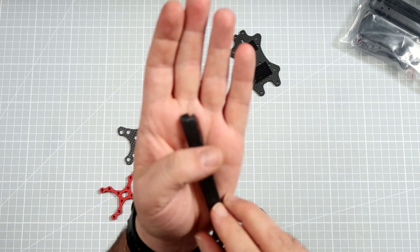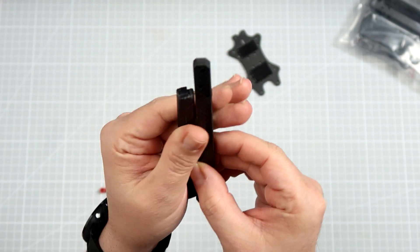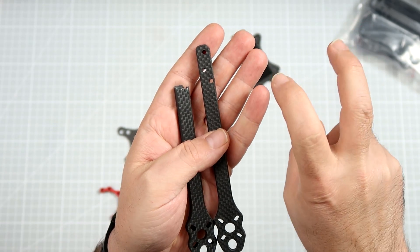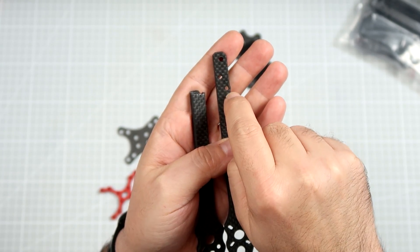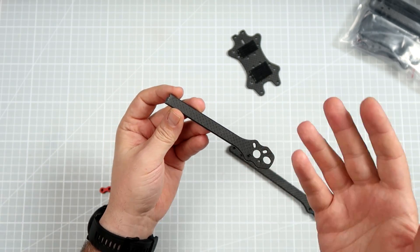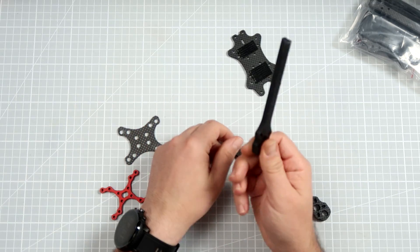I'll show you an example of the bad design. For the price, the Alpha Monster is great, but the arm just snapped off right here. Comparing it to an unbroken arm, you can see there's a mounting hole with a small bulge meant to make it stronger. Unfortunately, the hole is too close to the edge of the arm, so that small piece of carbon isn't really protecting anything. This is the weakest link — the most outward screw. With enough torque, and the carbon wearing off from vibration with micro fractures, the arm unfortunately broke off.